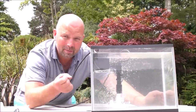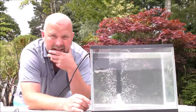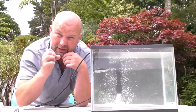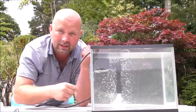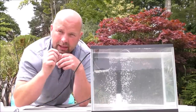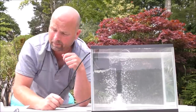Other than the bubbles popping up here, what we've got here is basically a venturi. So as the water is going back down your return pipe, it's drawing air in and mixing it at high pressure with the water and then spitting it out, so you get a really high dissolved oxygen rate in the water.